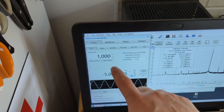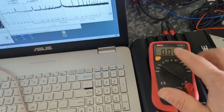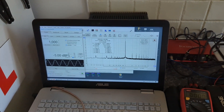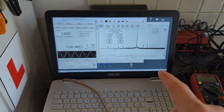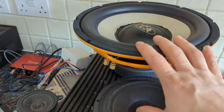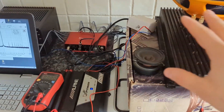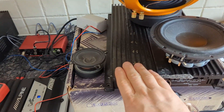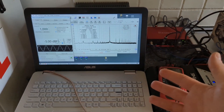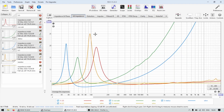The main tests I'm going to do are: a 1 kHz tone spectrum, a frequency sweep from 20 Hz to 20 kHz at a fixed minus 5 dBFS signal level, and a power sweep — all to see if there's a difference in distortion depending on frequency. For example, the subwoofers have an Fs around 60 Hz, so measurements should differ there. In total, that's five different cases — four speakers plus the resistive load — so five different scenarios.